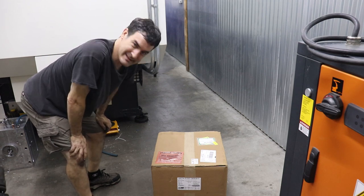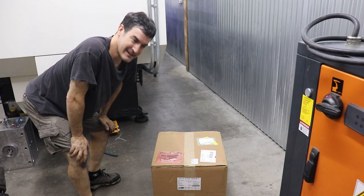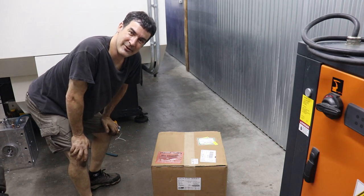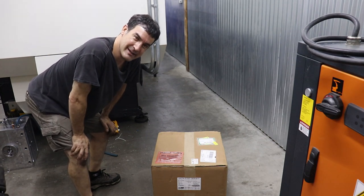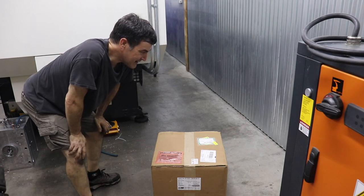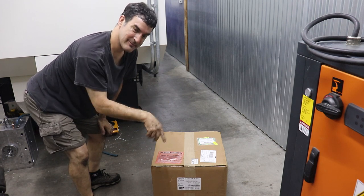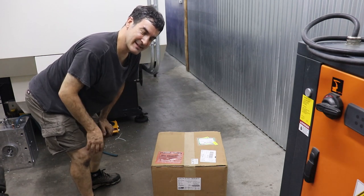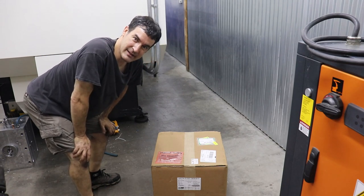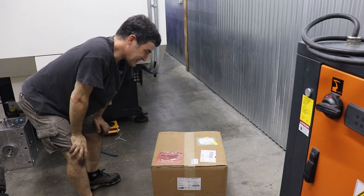It's falling apart, basically. When I first turned on the import from Amazon, the cooling fan exploded because it was an injection molded fan in a housing, and the whole thing just blew apart because it had an interference when it shipped. And then recently, when I hit the button up and down, sometimes when I release the button, the winch keeps going, which is not a good thing. And then the other day, the winch just started losing power and the mold started to slowly unwind to the floor. So I basically need to get rid of it.